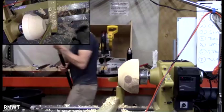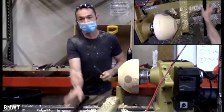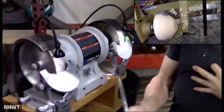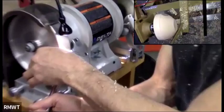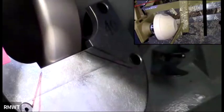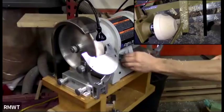We're just going to do a quick touch up on here. I'm not going to go too much into grinding right now, but to grind it, if I had a handle on it, I would be standing more where Hoyle is there, but I have the ability to take the handle off. I'm just going to do one side. I drag it across by dropping, dropping, dropping, and then rolling through the middle. That's one side, and then I do the other side. I go across, dropping, dropping, roll through the middle, and that's it. Then I just take the heel off on this one. Make sure I got it. Yeah, I got it. That's all it takes to sharpen it. It takes a little bit more to make it from scratch, but I'll cover that in a few minutes.